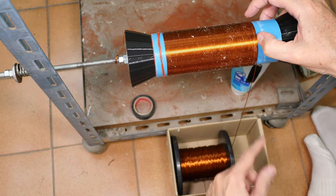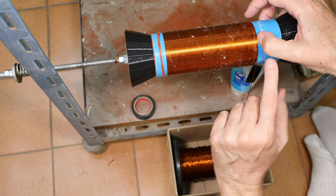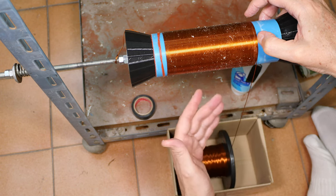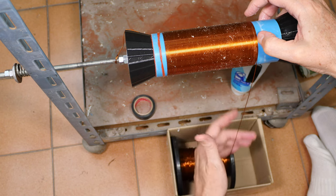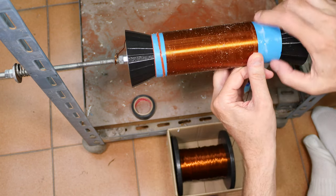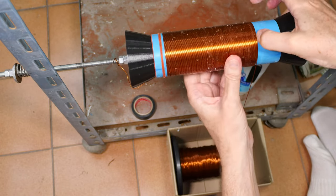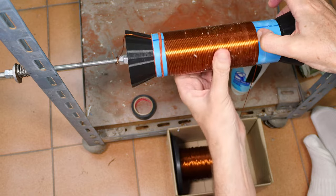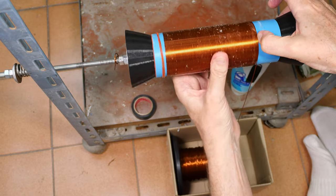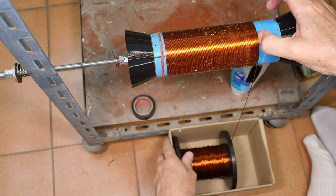So one benefit of having tension, you can see that I don't have to manually hold tension all the time. When it's going nicely, I can just let the wire tension itself. And here's a nice straight, smooth stretch, so I can kind of just let it do its own thing. And I just keep turning it, making sure it's laying down next to the last one, until I hit a section of wire that is no longer straight.